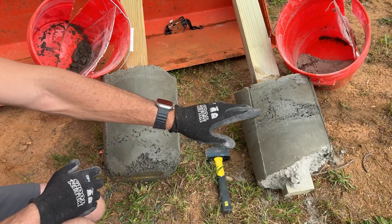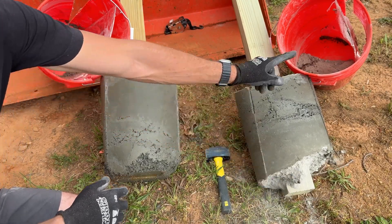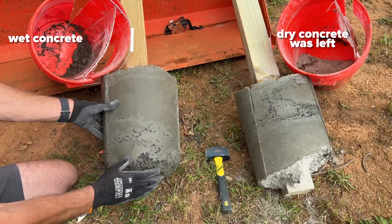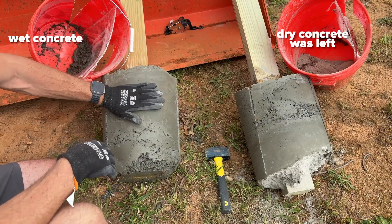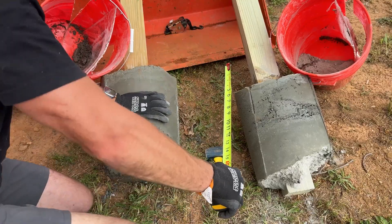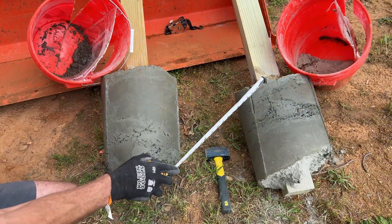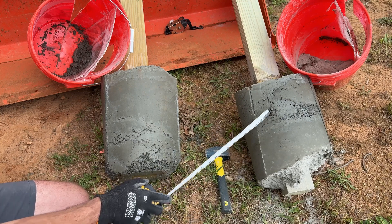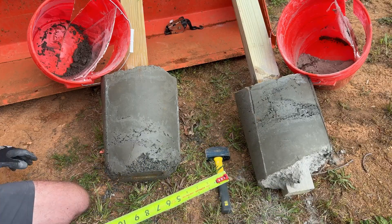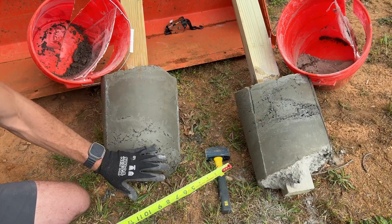Interestingly, test two — where we were poking with the rebar trying to mix it — actually did a worse job. There was dry pack on the bottom and still dry concrete left in the bucket, while test one had full water saturation all the way through. Measuring it, test one has about 14 to 15 inches of mixed concrete, while test two only has about 10 to 12 inches. Not sure exactly why — maybe that first water layer blocked the rest of the water added on top, preventing it from penetrating all the way down, while in test one all the water on top just kept working its way through the dry pour and fully saturated it.